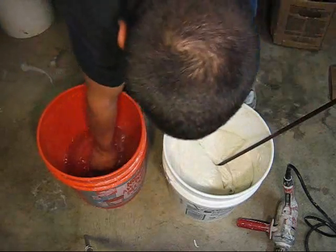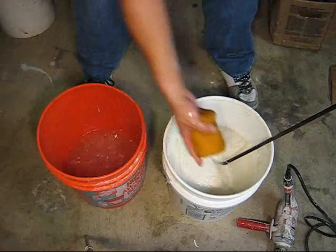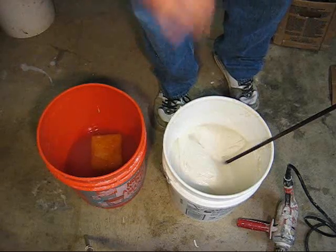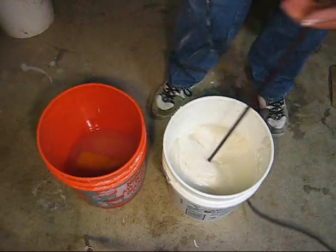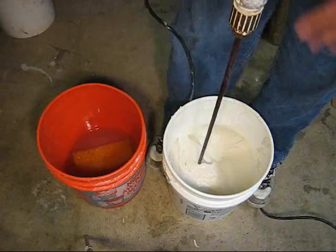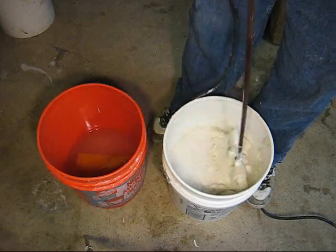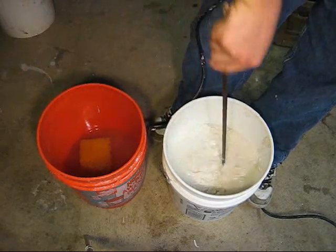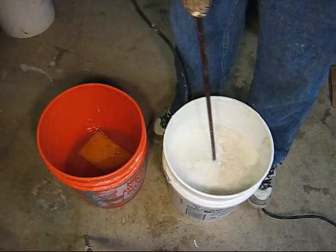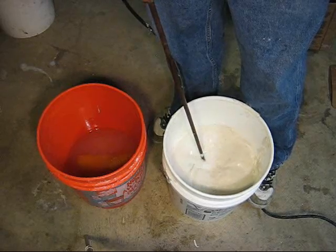Here's your good beater. I also use a sponge instead of always constantly leaning over picking up the bucket — it saves on the back fatigue. About three or four sponges usually gets it, but I'm doing it a little thick right now just to show you guys. Put your drill in, pop it in, just hand tight — you don't need any chucks or anything like that. Before you turn it on full blast, you want to kind of move it around a little bit, get it to barely mix up that mud, just a little bit. Hand tight on the drill, and give her a couple little whips.